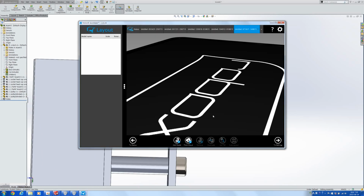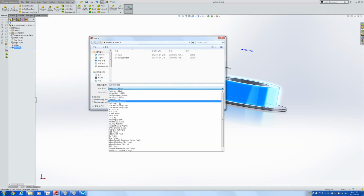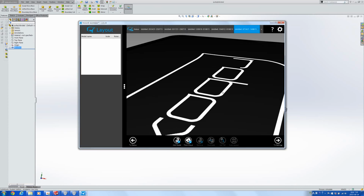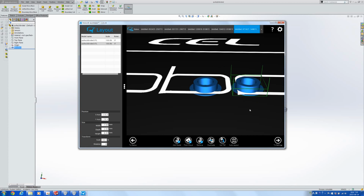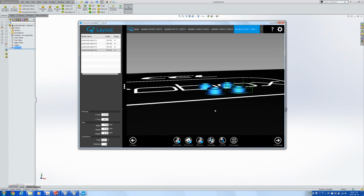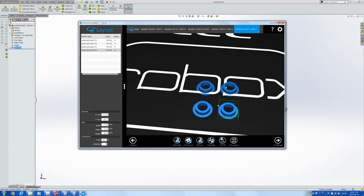And let's see what will happen if we try to print this one out. Print the divided pulley out. Let's save it as an STL format once again. All bodies. Let's add this. I have to lay that flat, but also we'll have to duplicate it. We will need to duplicate it 4 times if you want to make 2 pulleys, but then you can very easily see that this is going to be a very, very clean print job. It's not going to require any support. And all you need to do is print it out and then put it together so that these parts will come out in a very clean fashion.